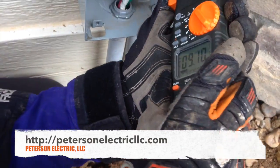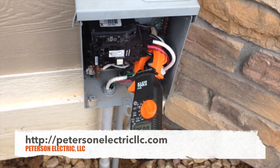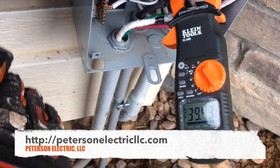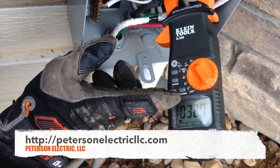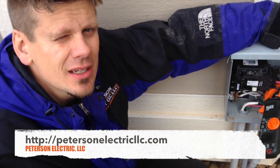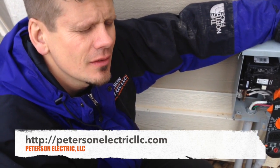If I go to my other leg — it's really hard to get in there — turn that tub back on. Now we're running hotter here: 40 amps. The inrush current on his pond pump is 5.5 amps, but when it's running it's 4 amps, so we're at 38 amps total. This wire is being fed from downstairs on a 60-amp breaker, number 6 gauge wire, THWN-2, so it has a 90-degree Celsius rating — that's going to be good right around 60 amps. Check NEC 310-15 B15 if you want to verify.